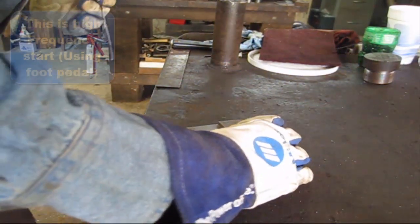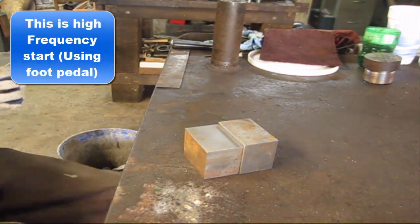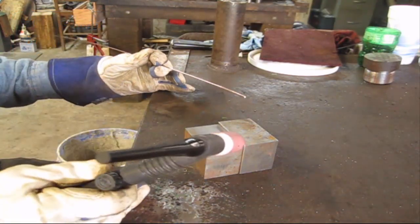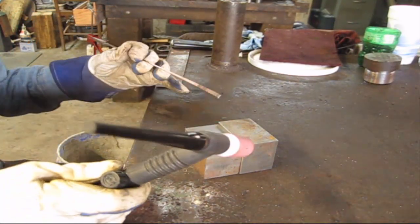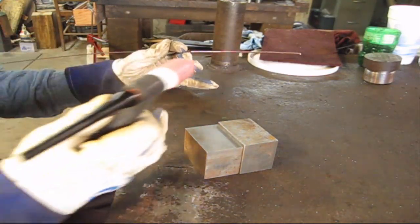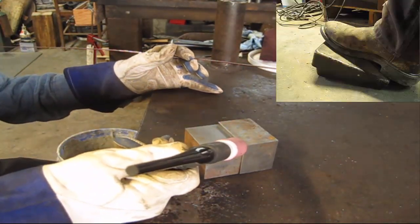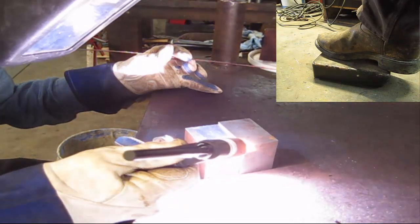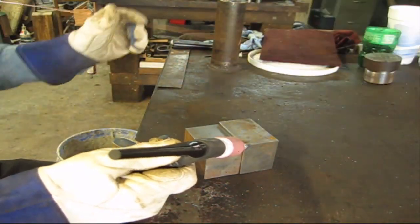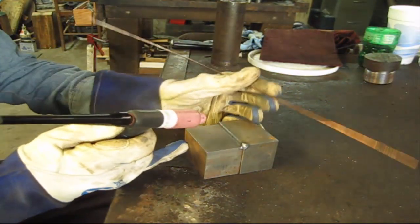I've got a little lap right here I'm just gonna practice on and show you all the TIG torch angles and everything, just to make sure. I'm gonna put 2 tacks on it real quick and then we'll go from there. I'm gonna show you a fusion tack versus a stick tack. So we'll just put a little fusion tack right here. That's with no filler wire. So I'll show you one with filler wire.